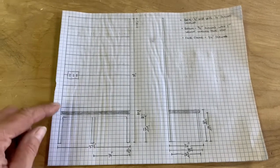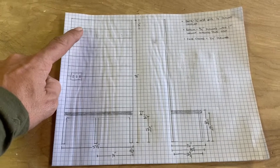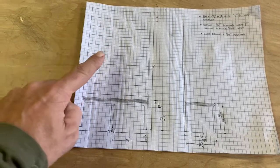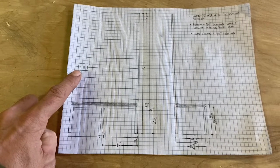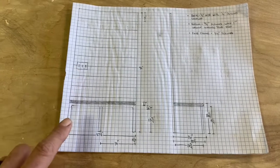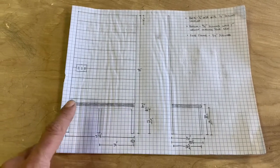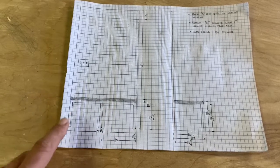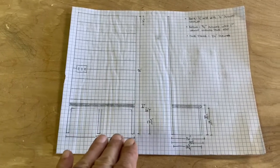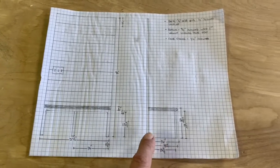So here's the plan: it's going to be six feet tall with a half-inch MDF back, and quarter-inch birch plywood cut into six-inch strips glued to it to make it look like a shiplap back. He has a three-gang light switch that I'm going to have to cut around and extend out. This is going to be a 16-inch front-to-back, 37-and-a-half-inch wide bench top with a face frame cabinet underneath with a center divider, so they can slide some baskets underneath.